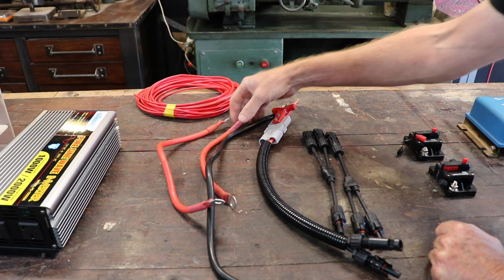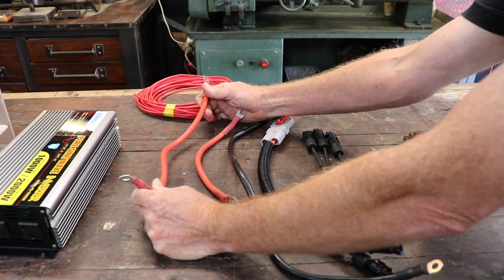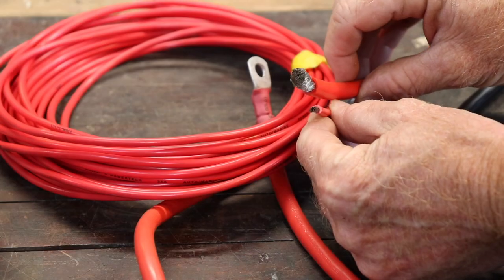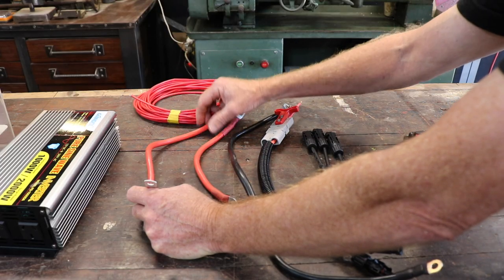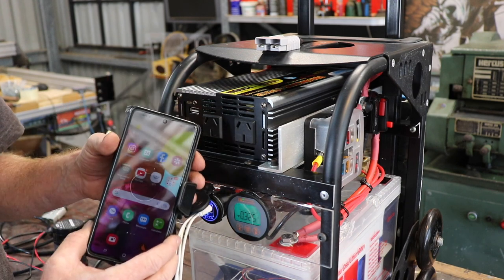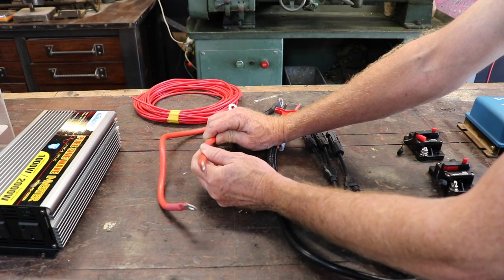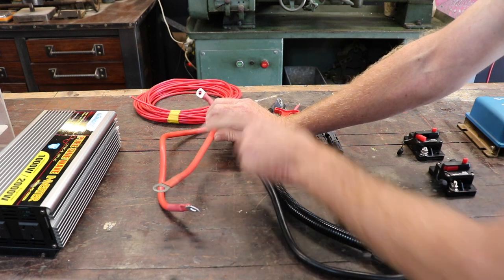Here is some of the cabling I've used. You'll need to get cable sizes and terminal lugs that are rated for the power needs that you have. This wire here is 25 amp wire — you can see it's quite small. 25 amps for DC is often adequate for small things like a USB or cigarette lighter type stuff, charging a few small portable devices. But supplying an inverter using 1,000 watts, where you're going to need about 100 amps, you'll need cabling that can handle carrying that amount of electricity.